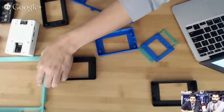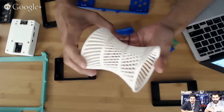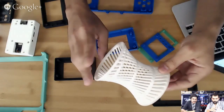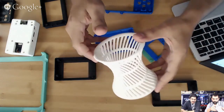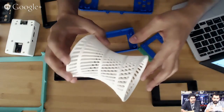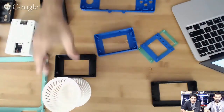Some other cool retraction tests we were doing on the LulzBot Mini — this is a beautiful and rather complicated print. It's a helix — a little pencil holder designed inside Maya using some linear deformers. This is mainly just a test for retraction settings, quality, and Z-height. Literally hundreds of retraction moves with every little movement. It looks phenomenal. I've printed this on quite a few of our other printers and they don't fare too well, but the Mini seems to do really, really great. It's very strong too.